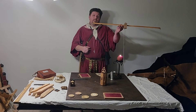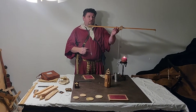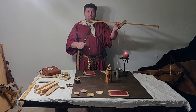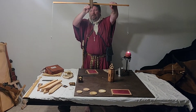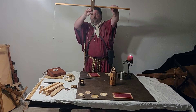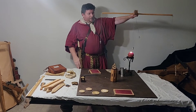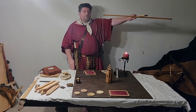As much as this was considered the de facto tool with which to do surveying, it has, as you can tell, a number of problems when you are trying to line up a set of dangling plumb bobs. If this is how you're lining up a line to go ahead and measure long distances, you're asking for trouble.